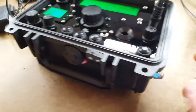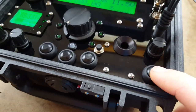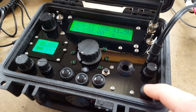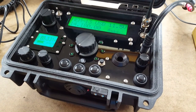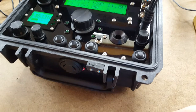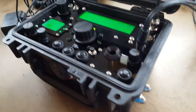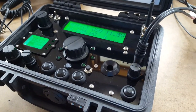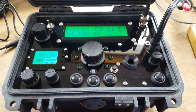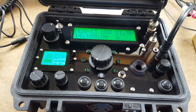Back to the touch keyer for a moment. I went over the speed control, so you can change that on the fly. It also has memory keying — I haven't programmed in a call sign yet, but if you wanted to send your call sign with the touch of a button, you can press that. And there are many programmable settings for the weight. You can reverse the keying — I send backwards because I learned it backwards. There are also lots of different options for beacon mode, so you can set your radio up, call CQ, and walk away for a few minutes. If someone calls you, you can run back to the radio to respond.